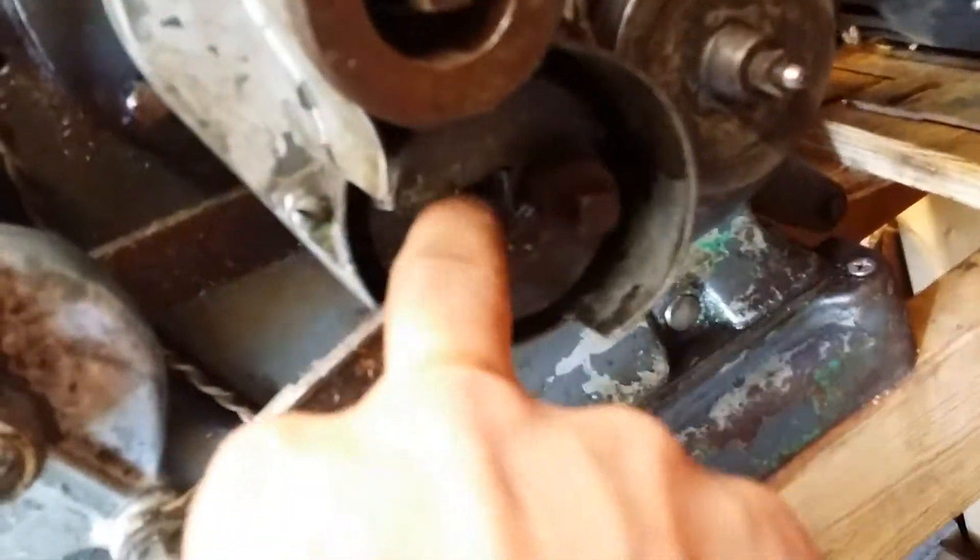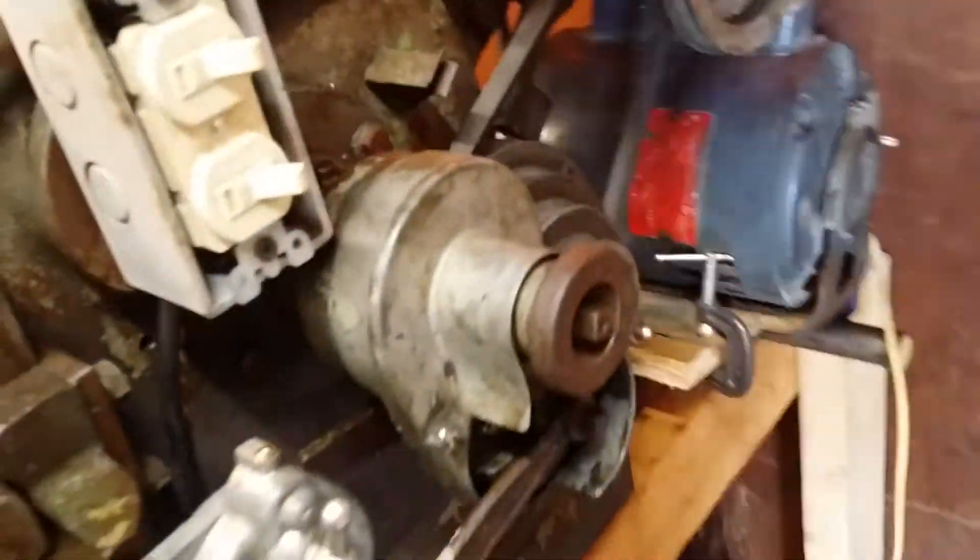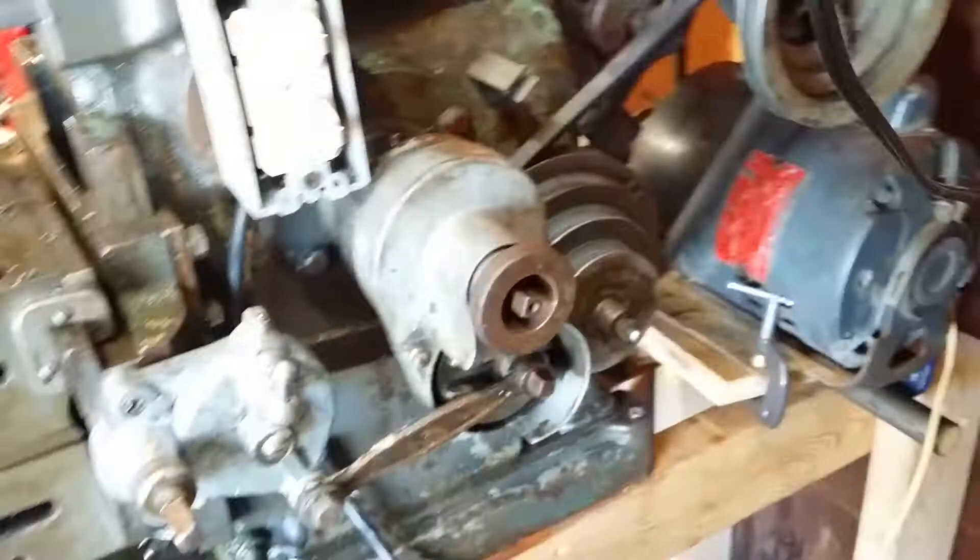There's a nut that's been screwing with me as far as trying to change the belt speeds. See that shiny little nut down there? It had a really fat nut on it and I couldn't change the belt speeds. This bolt right here — on the back side it was extra fat, fatter than it needed to be, and it wouldn't allow me the clearance I needed to change the pulley from one speed to the other. So I took a normal size nut and thinned it down a little bit more.